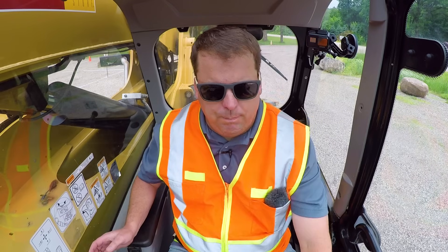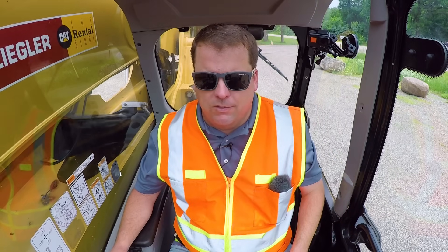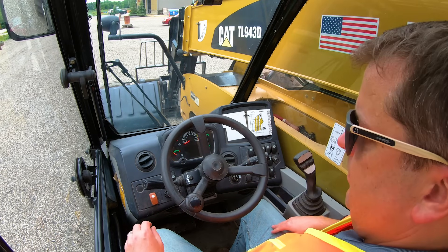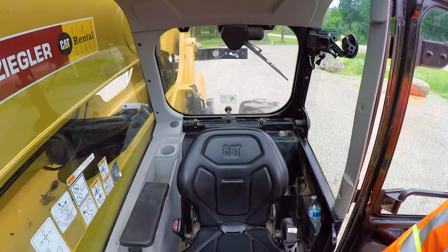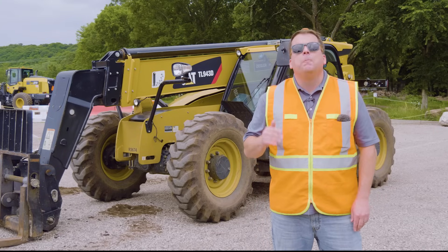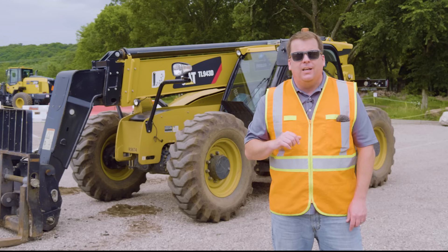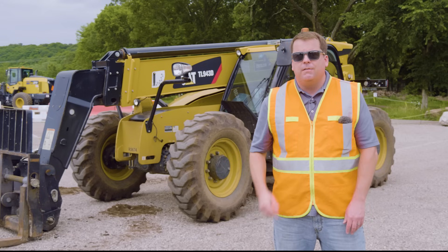Put it in neutral, park on, and I'm going to set this down. You always want to have those forks flat on the ground so they're not a tripping hazard. Put it in park, shut the machine off, and get out — three points of contact. So those are the basic controls for a telehandler. In the next video we'll go over how to actually pick up and move things. Want to thank Doug Speedlink Construction in Hastings, Minnesota for allowing us to use their machine. If you run one of these daily, please put in the comments below and share any tips or tricks.